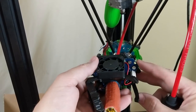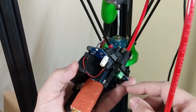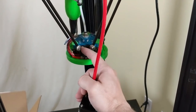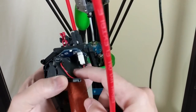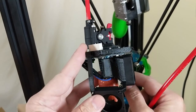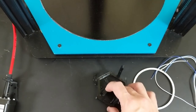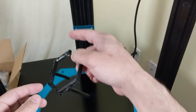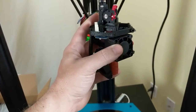Speaking of part cooling, these black parts — this triangular piece up here which mounts in place of the metal blue piece — all these printed parts were made out of PLA as test prints. I've printed up all those same parts out of polycarbonate, a really high-temperature resistant plastic that shouldn't deform being so close to the hot end. I think this is going to go quite well, but there's still some work to do after I get this mounted.